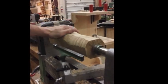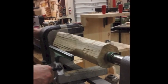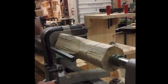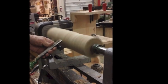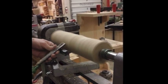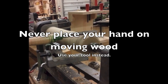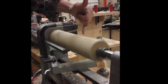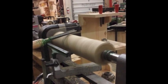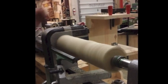As I begin to trim away a lot of this wood, I want to revisit the pieces of the lathe to make sure everything's secure. I can come back down here and start turning this part so it stays balanced. As I start getting it closer to being round, I can put my tool on top and really see where it's getting round and where it needs work. I look up here and can see shadow lines of where it needs to be cut down. I can also turn it off — I still have some flat spots here, but this part is pretty. There's a flat spot there, so I still have some work to do.